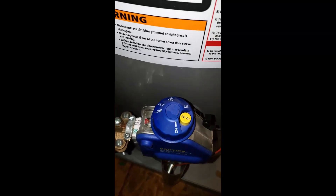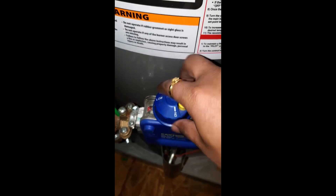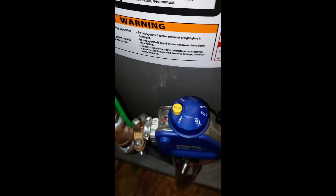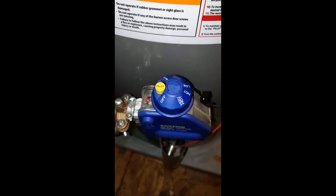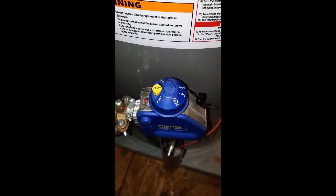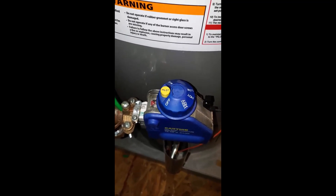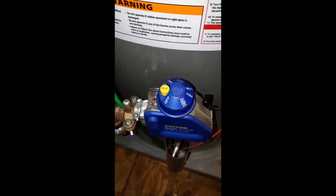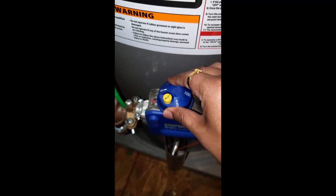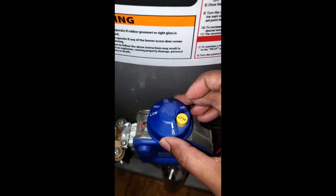Vacation mode is a popular term, but it also means you switch the heater to pilot mode. I can just turn this dial and now it's in pilot mode — you'll see the red arrow pointing to the correct setting. In pilot mode, heating won't occur while the water is off, but the unit isn't fully switched off either. If you're going on vacation for three to four weeks or more, you can switch it all the way to off. I'm going to set mine back to on at a low heating setting, which is my standard.